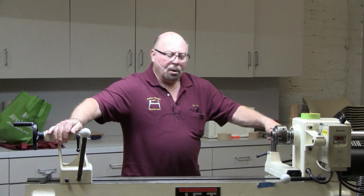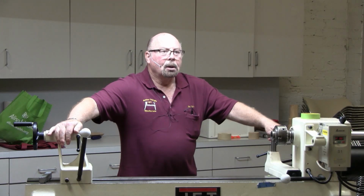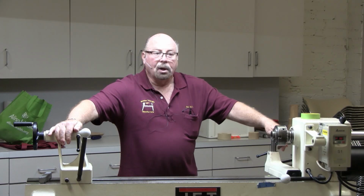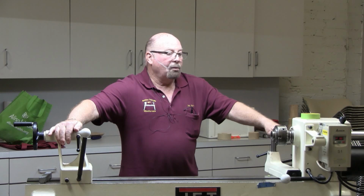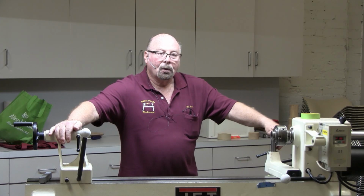About a year or two ago, I had done some work with Ben Foe, and one of the tricks that Ben does with the wood that he turns when he finds a nice piece of wood is that he puts it in the freezer, and by freezing the wood, it keeps it from cracking until he's ready to turn it.